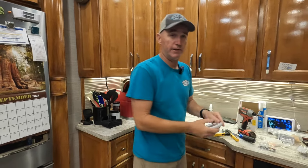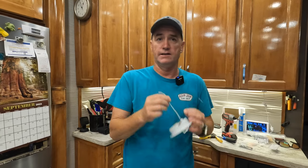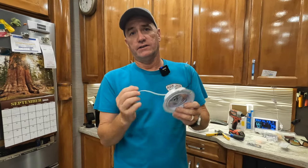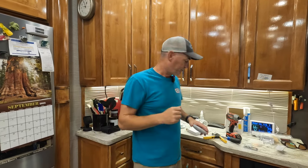The new ones are black and red. Now in most RVs — I'm going to say about 99% — white is your ground and black is going to be your hot. When you pull down a light you might have yellow and white, or orange and white, but white is going to be your ground. So keep that in mind: white is ground, the other color is hot. Don't think black is always your ground in an RV.